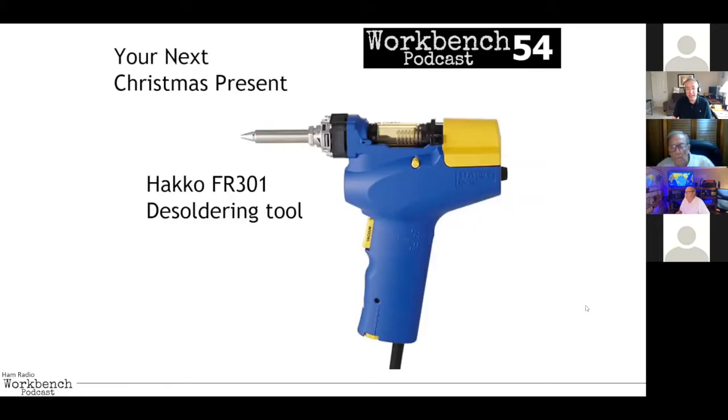So this is an optional item. We talked about this in episode 54. This is a desoldering tool. And when you first look at this thing, these are pretty expensive. They're around $250. And it's a vacuum pump desoldering tool. So the tip gets hot and there's a hole in the tip. You put the tip over the solder joint, you pull the trigger, and the thing sucks the solder up into that transparent chamber. If you do a lot of building, this is a luxury item that I would really recommend you consider.